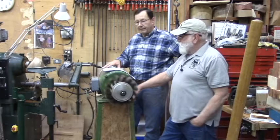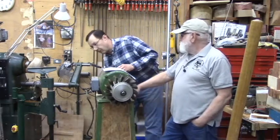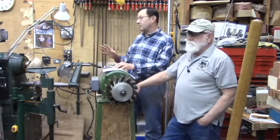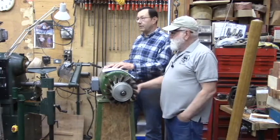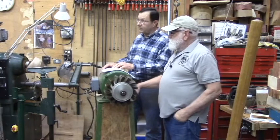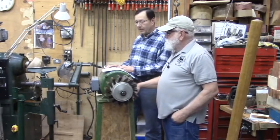Also, you want to check if there are any vent holes. This one, the vents are on the bottom. But if you can, get your nose in there and take a sniff. A sniff test works really well with a motor, because if it's burnt, you can tell. You can smell a burnt winding. Bearings or a stiff shaft don't trouble me as much as a burnt odor.